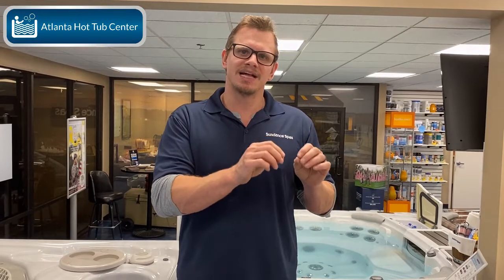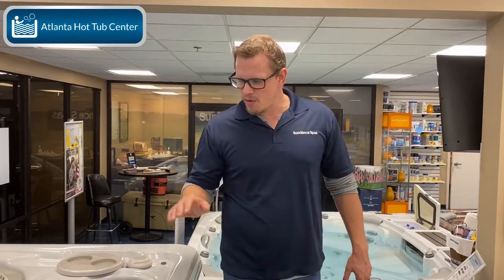Something I want to give you a hint on: if you're really struggling to get your pH to stay in the ideal range, get your alkalinity right. That's kind of the base for your pH. If you want to keep that pH in the ideal range, get your alkalinity in check. So if you're at home watching this video and always struggling with pH, take a look at your alkalinity and see where that's at. And calcium — if it's super low off the charts, put a little bit in a bucket, mix it in there, and make sure it doesn't have a chemical reaction before you dump it in.